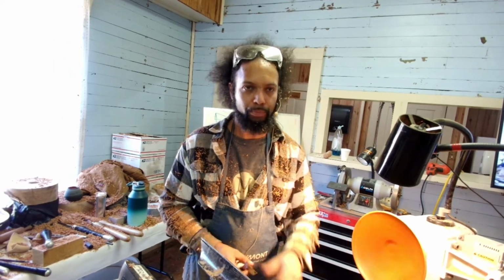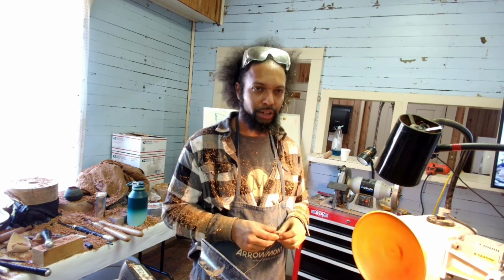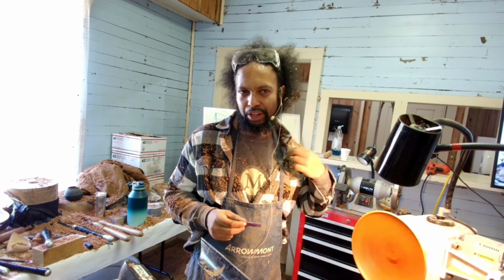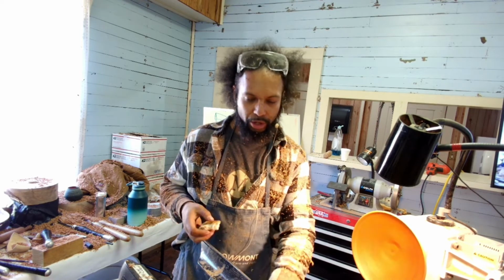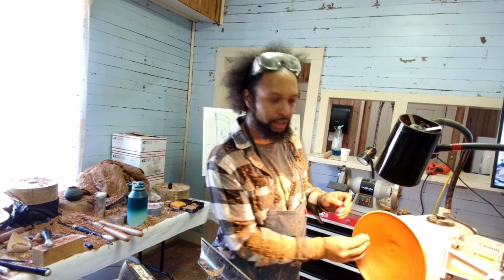You would just do a walnut oil. I would put a coat of probably Mylands, and after that I put some carnauba wax on it with the Beall. That's usually how most of my finished pieces go. If something's going to ship out, that's what I would typically do.